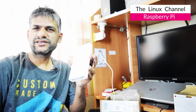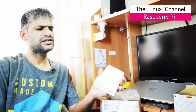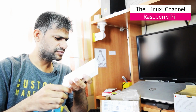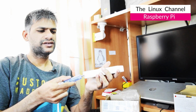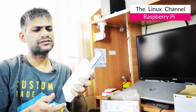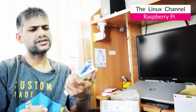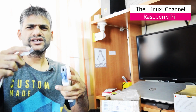Okay, so see, for instance, this is my Xiaomi power bank. This is a 20,000 mAh power bank, and what I can do is measure its power characteristics with this USB power meter. So I can hook it to the same, and the moment you hook it, it is not going to turn on, so you need to enable it. Once you click this button, it is going to show its characteristics. If no power is pulled out, it will stay in idle mode.